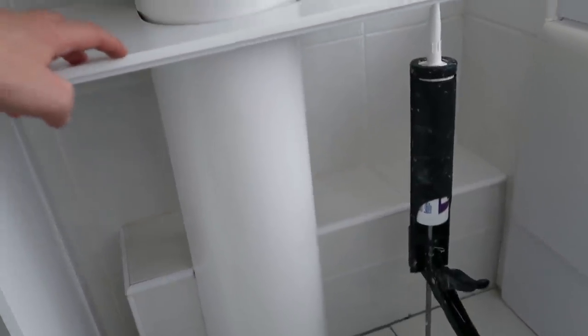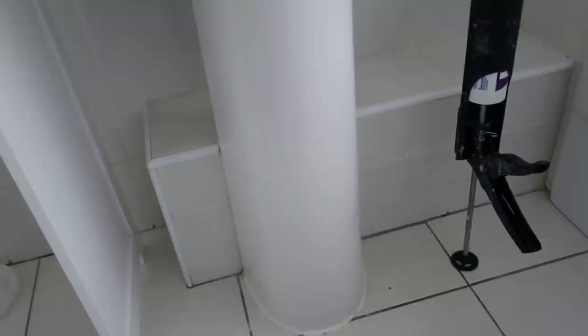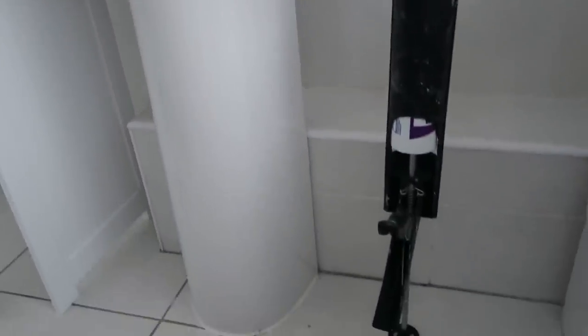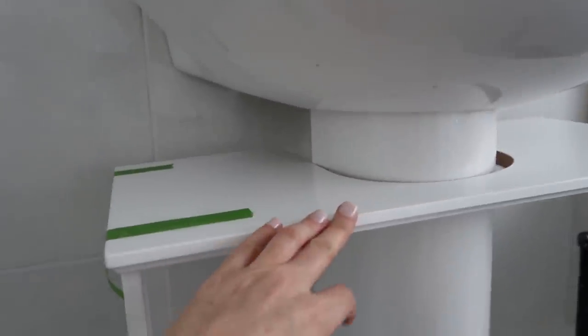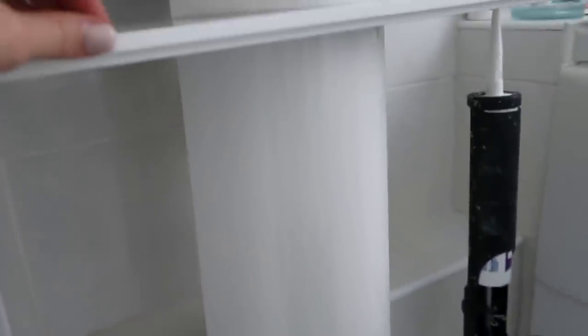This is slightly precariously balanced because I really do have to hack the unit apart to make it fit around my sink. On the right-hand side I also have to notch it out to sit around the boxing. Because my sink is so far forward, these under-sink cupboards only come in 30 centimetres deep standard, so it was never going to reach all the way to the back wall. I may buy some extra architrave moulding or beading to fill in that gap.